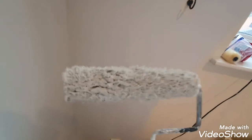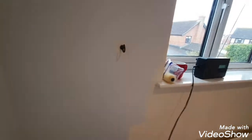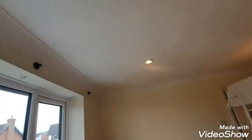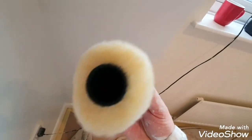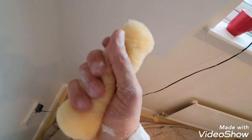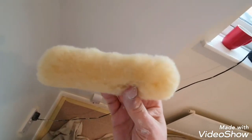Great bit of kit, must-have for all decorators, even novices. If you want to paint a room out, don't worry about using a bigger kit - this is quite a fair size bedroom. I did the ceiling this morning using the Cirrus X, swapped between the two, and I think they're both as good as each other. This is the Jumbo Coater, so you need to get the proper frame - don't buy just a normal rad roller frame because it's hollow inside.